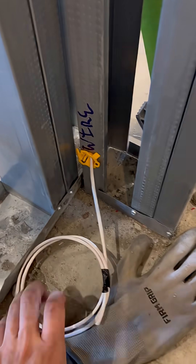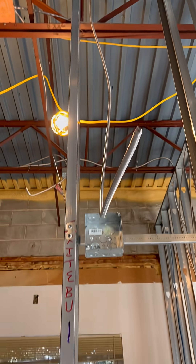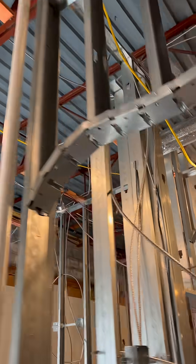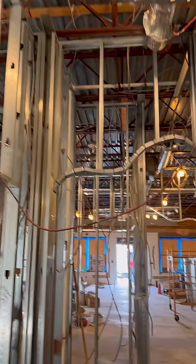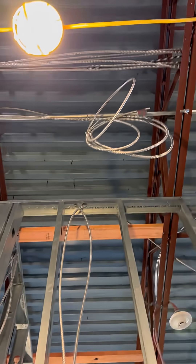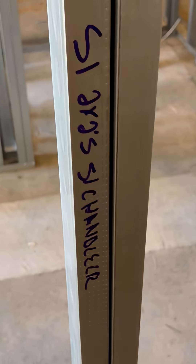There again is some more low voltage wire for that LED strip tape. Like I said, there's going to be a piece of baseboard with a chamfer in it, and that strip tape is going to follow that chamfer all the way down, so it's going to be a lot of work. Eventually we'll probably solder everything, because that is my method of choice for wiring strip tape — I like to solder everything instead of using crimp connections. I just think the solder is better.